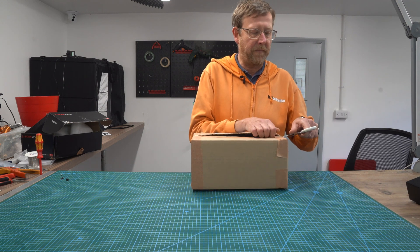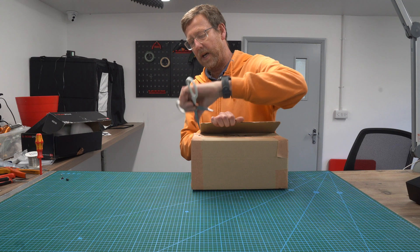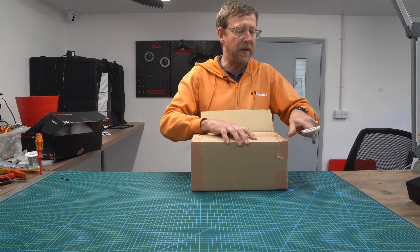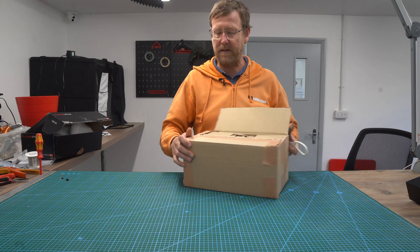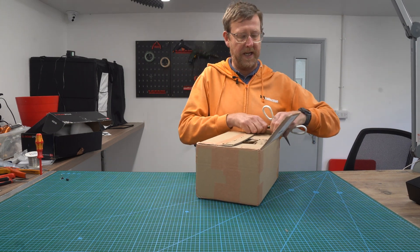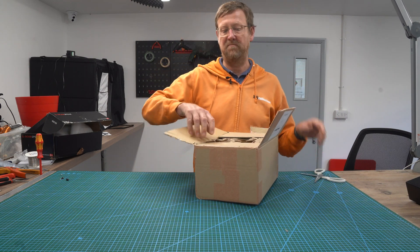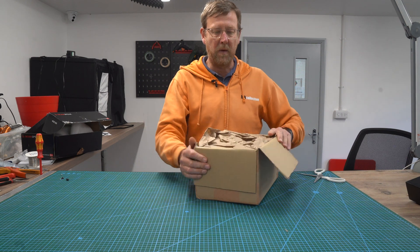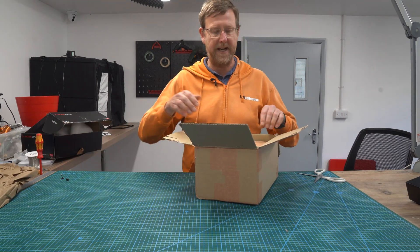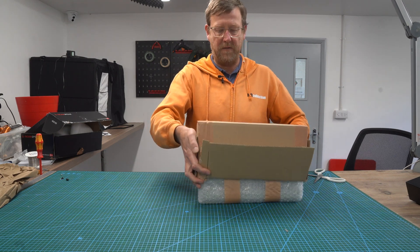The cabinets are made of 12mm marine grade MDF. Marine grade because it's better at repelling water — it's not as absorbent as standard MDF. It's green, but that doesn't matter. We will do a series of videos about how to veneer and cover your cabinets.